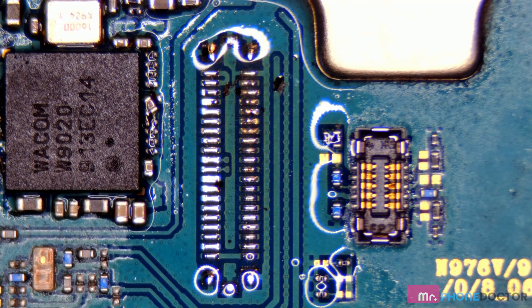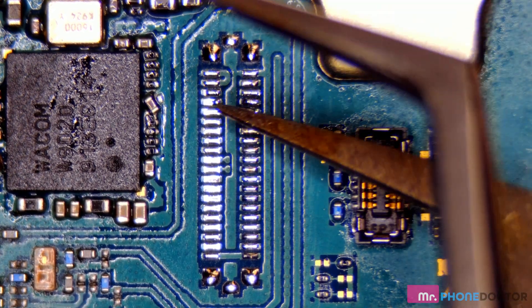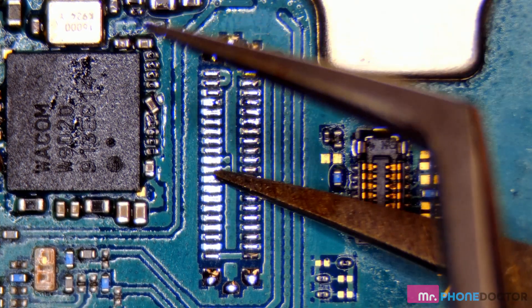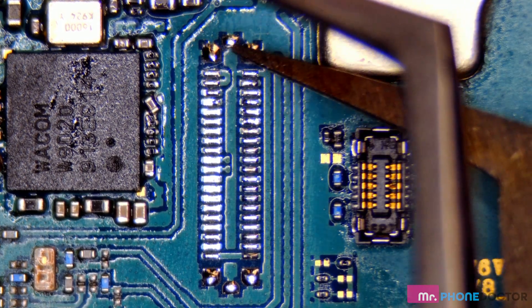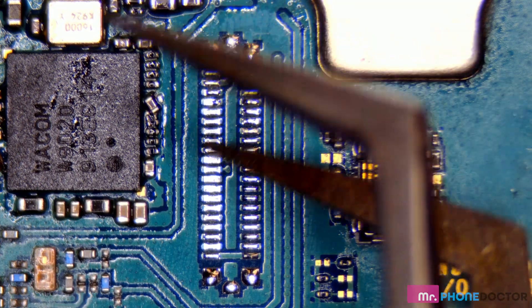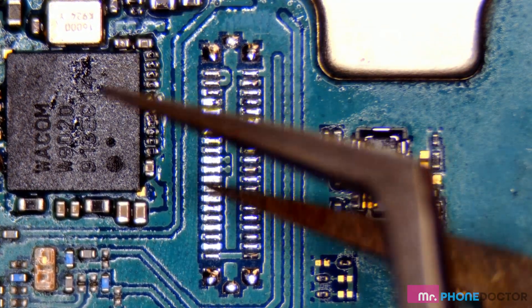The board has been re-balled. I'll clean it and inspect my work. You can see there are a few areas I did miss — there's one area here, and these other areas look okay. Me personally, I would probably just redo all this because you can see these grounding areas have a little bit too much solder. I don't want too much on these because the board will not want to sit down when I reapply. And these other spots are lacking solder.